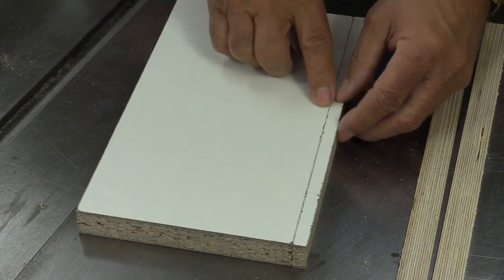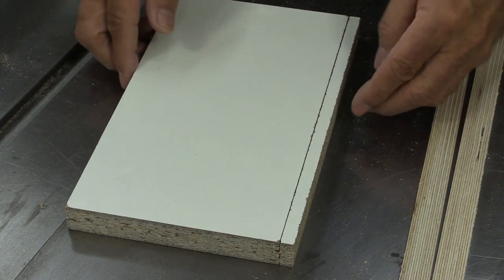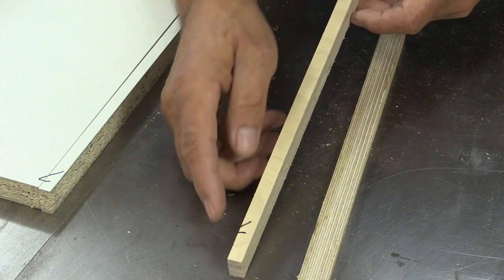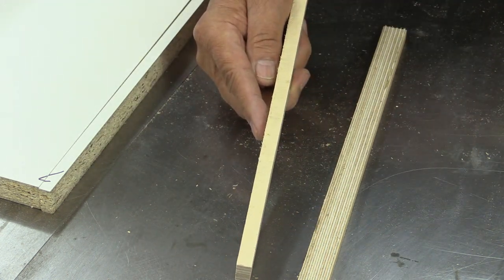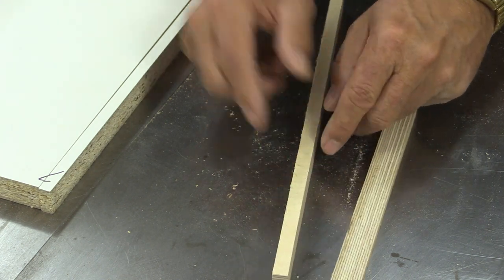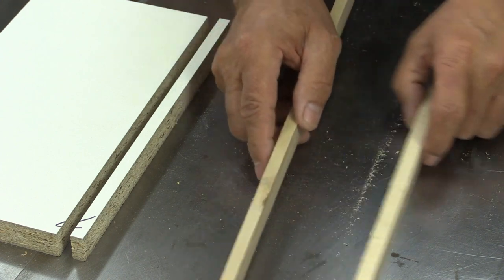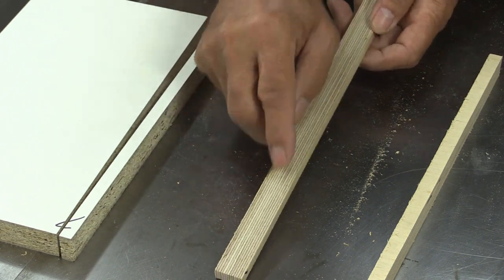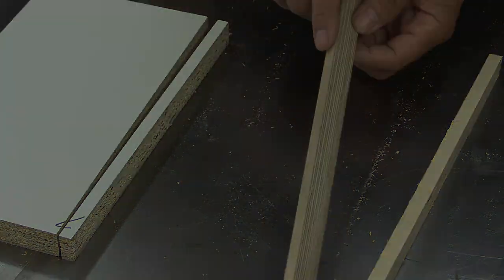Here's the double-sided melamine — the top always looks the best, but when we flip it over with the 40-tooth blade, you can see you really need a specialty blade to get a good cut on the back side. Now here's the plywood cross-cut — that's actually a very nice clean cut. Comparing the cross-cut and the ripping blade results on plywood, you can really see there is a big difference. The 40-tooth cross-cut blade is clearly cleaner. The ripping side of the plywood did a nice clean job, just a little bit slower.